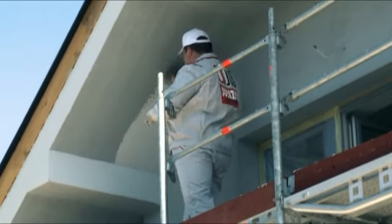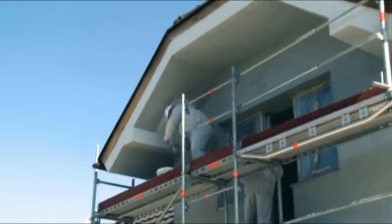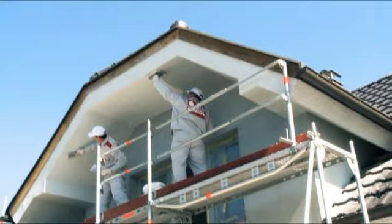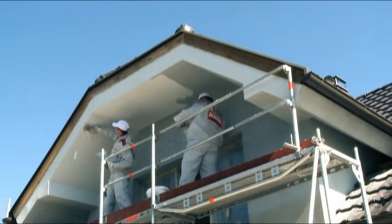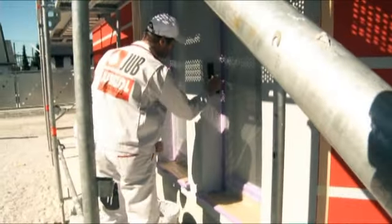During the application of decorative renders to facade surfaces, respect the rule that the application should always start on surfaces located higher in order to avoid damage to the render in the lower working area. Further, reveal surfaces of window openings are always processed first, and afterwards the larger facade surface is processed.